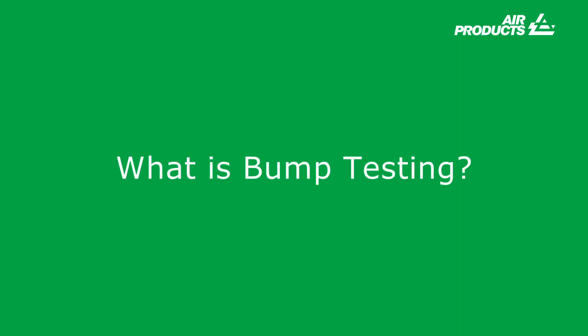So what is bump testing? Bump testing is the application of standard test gas to a detection instrument to verify the functionality of sensors and alarms — not its accuracy. In previous years the reasons for this may have been difficult to understand, and misleading information about so-called maintenance-free instruments led to a misplaced sense of security. If we consider that the output of a typical sensor in clean air is zero, this is the same as the output of a non-functional sensor. So exposing the instrument and sensors to gas is the only way to know that it will respond to a hazardous gas that may be present in the atmosphere.